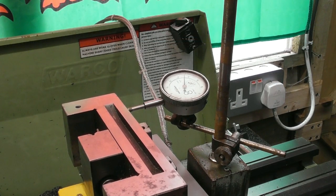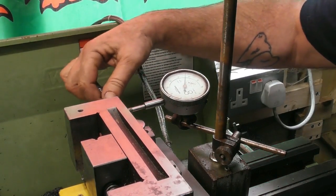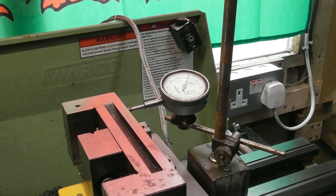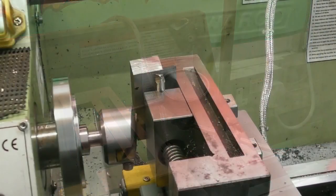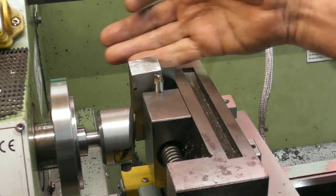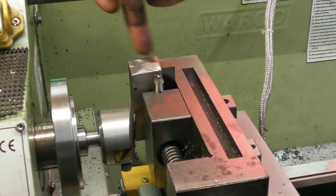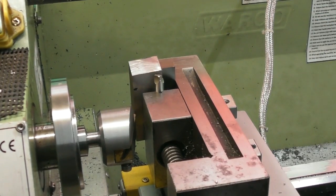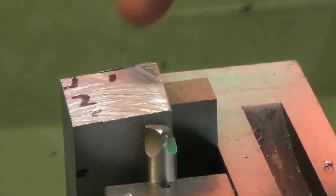Well, here we are. We've clocked up the vise. Let me just nip that, see if I change things. So usual practice, circular rod on the moving jaw, push back against the face I just machined, and I'll then know when I machine this space that these 2 corners are 90 degrees to each other. And then I'll just work my way back round like that, tapping back against the parallel, and we should have a nice square block to start with before we machine it down to size.